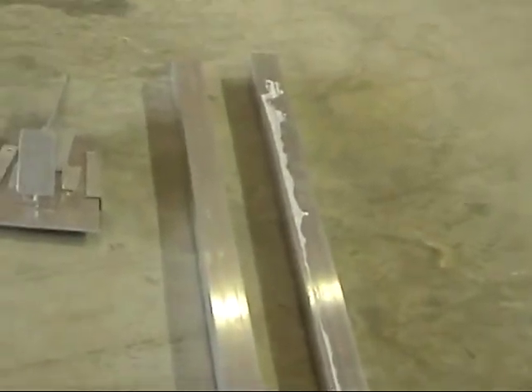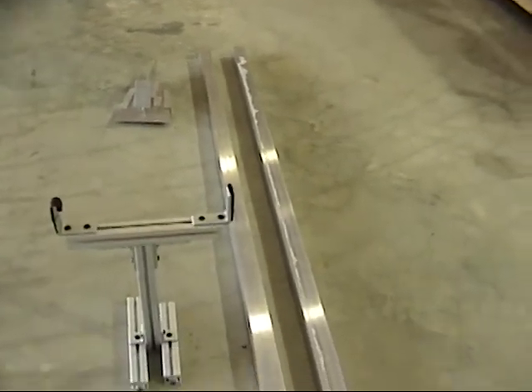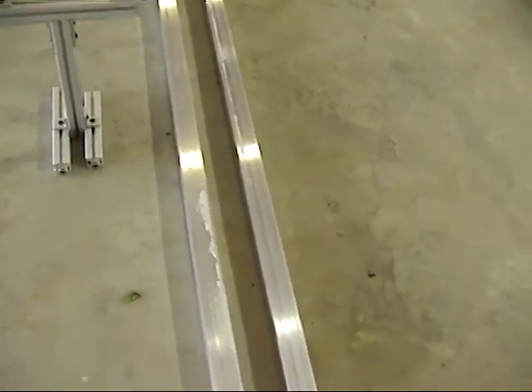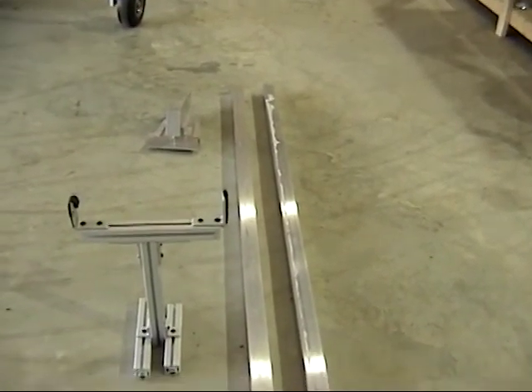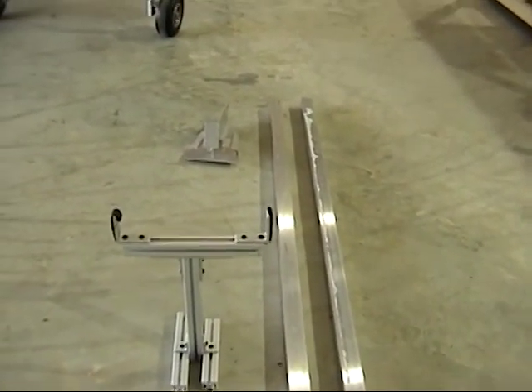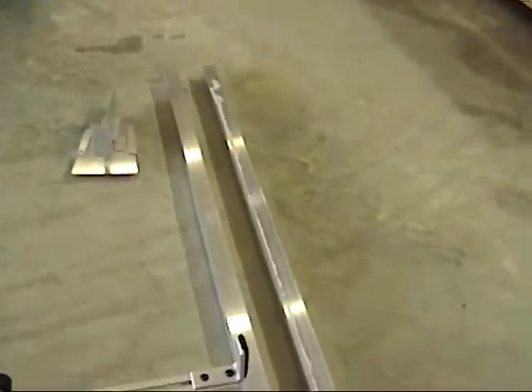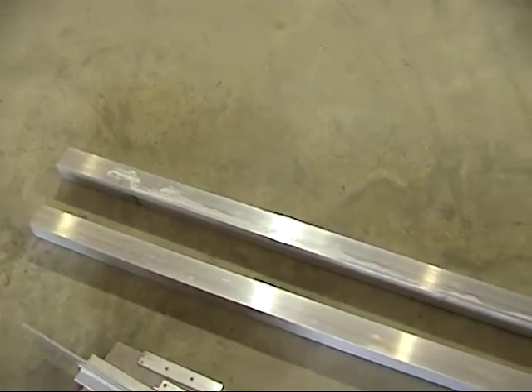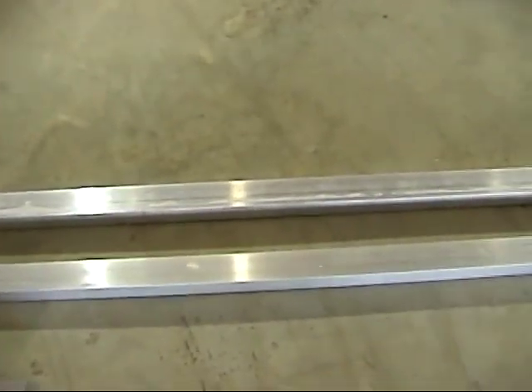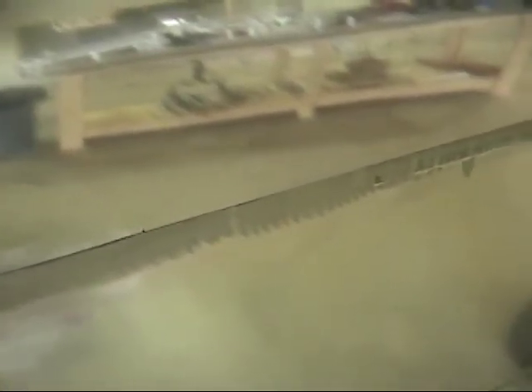You can see when you clamp these two long bars on the outside with the adjustable clamps from Home Depot — the gripper kind — they work really nice. I also put masking tape on the edge that went against the fuselage. That way it didn't stick, and then you just peel that off and what happens is you get a bond like this. Really nice — you get good squeeze out all the way along.